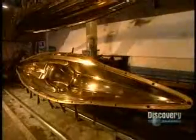The graphics are laid on the mold before molding begins. This way they're well impregnated in the plastic. It's an operation that requires quite a bit of dexterity because, contrary to self-adhering stickers, these graphics can't be lifted off if they haven't been well positioned.